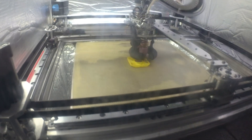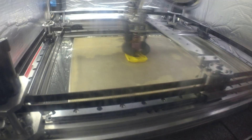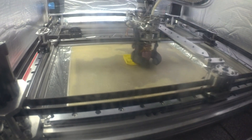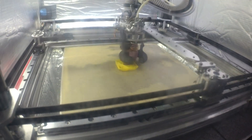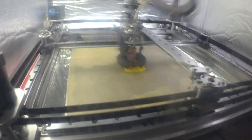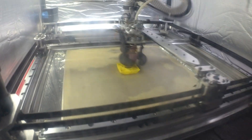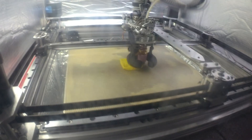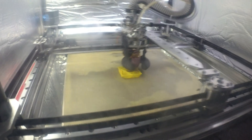You can see some infill not connected — sometimes it just tries to put it in a place where it can't stick to anything, or you've got your PA not set right for infill. That seems to change based on the speed, so when I crank it up higher I've got to lower the PA for infill. If you get it too high it'll totally jack it up; too low jacks it up too — can't win.